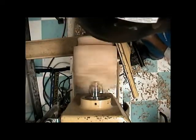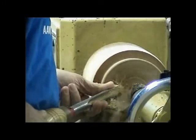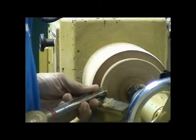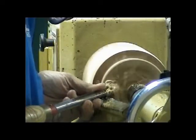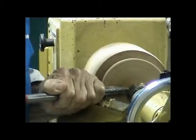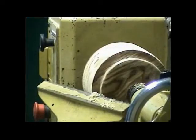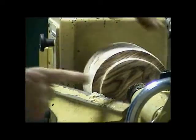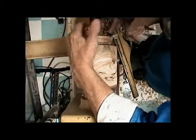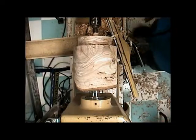Now I'm going to hollow out the end where the faceplate is going to sit. The hollow is a lot easier to make than a flat, and it will help center the faceplate as the outside of the faceplate will sit firmly on the edge of that little tiny bowl shape that we're making. So we'll actually make a very shallow bowl, and we're going to use a little scraping cut to clean that off. Then we'll check it with a straight edge. What I want is right in the middle to have a gap of about an eighth to a sixteenth of an inch, so we get that very shallow little bowl.